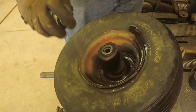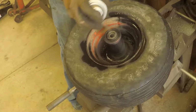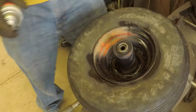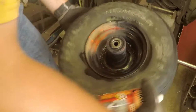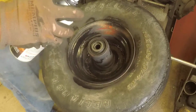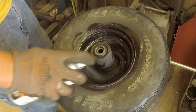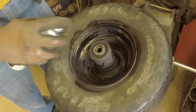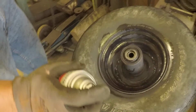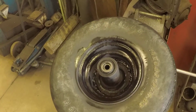I realize this isn't the most professional way to do this, but I mow my 4 acres of grass with it, and I don't really care what anybody else thinks. This ain't a show mower, is it? No. If you go look, I've got a radiator fan on the back of it, permanently mounted to help suck the heat out of the engine because it likes to run a little hot. It's got a Jeep radiator fan on it. Actually, it's not a Jeep, it's some weird one I had left over from a project, but yeah, we'll call it that. Oh, I thought it come out of your Jeep. I don't actually remember where that fan come from. I hooked it up through the auxiliary light switch, so when we turn the mower on, the lights come on, or the fan comes on through the light switch.